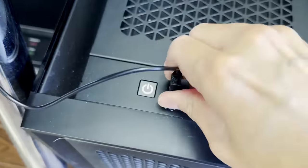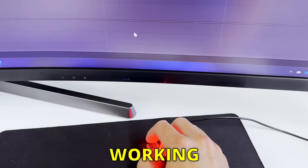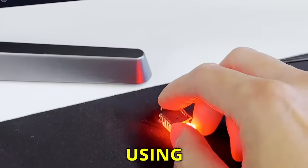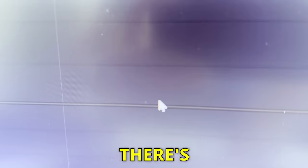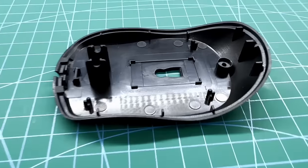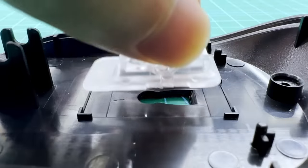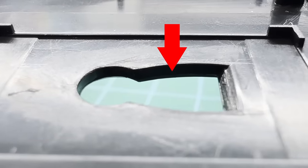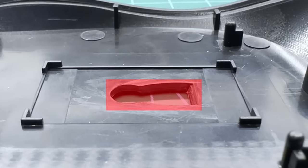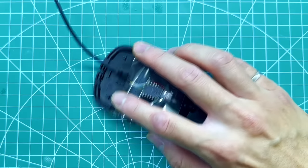Let's test out the new mouse. Here we go! Oh my god, it's working! This is so freaking cool — I'm using the world's smallest mouse. But there's something off about the movement. If we take a closer look at the bottom of the original mouse case, we see that there's a slight lift where the lens sits on top. This lift allows the red LED to light up the table surface for the image sensor.